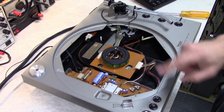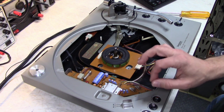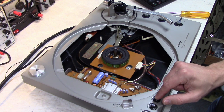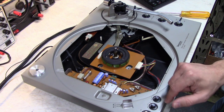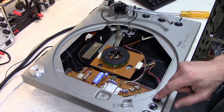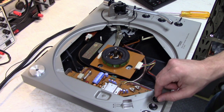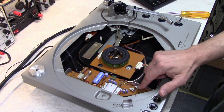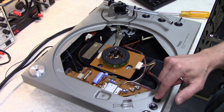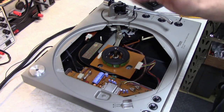One thing you can do if you're having trouble getting the speed exactly on — like when you get close it jumps — usually that means these pots are getting worn out. You can try to use some DeOxit on there to try to get these pots cleaned up. But another thing you can do is to move the position of the sweet spot to a different place on the pot by adjusting these trimmers slightly, which will let you wear a different part of your potentiometer and give you back your precise adjustment.